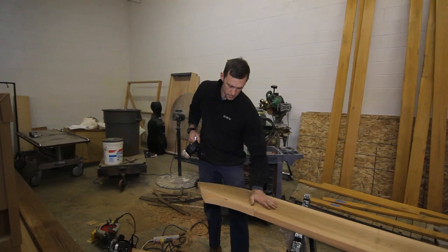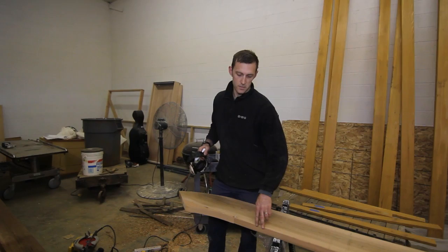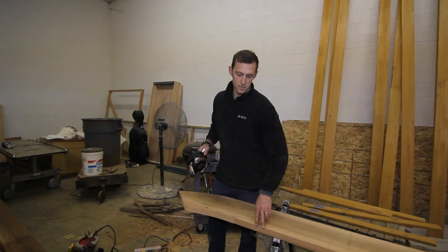The only thing left to do, excluding putting it on the house, is detail it up. We've got to continue the round-over from the factory all the way out, belt-sand the joint, do any filling that needs to be done, and then we might prime it before we get up there. We'll see how moist the lumber is — if it's a little too moist, we'll wait to prime it until it's up on the house.